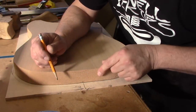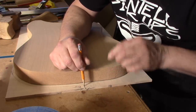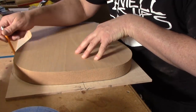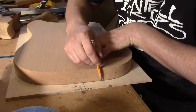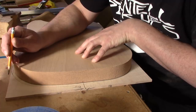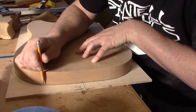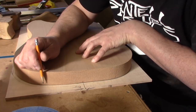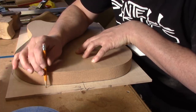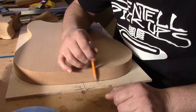So I've got the center line on the top — actually the glue surface of the top — and here is the center line on the edge of the body, and I've got that all lined up. I've drawn a line around the body blank and extended the line where the comfort contour is going to be, just to make sure we have plenty of bendable surface. It's usually not a big deal to cut this out exactly right since we've cut it a full half inch or three quarters oversize anyway. But remember the top bit is actually going to be bent, so having a little bit of extra meat there is not the worst idea. Let's go over to the bandsaw and cut it out.